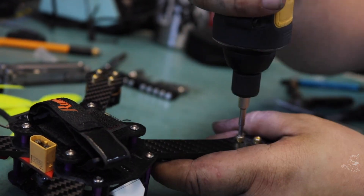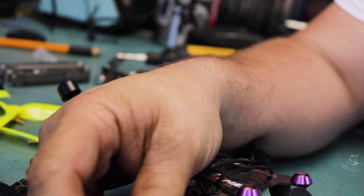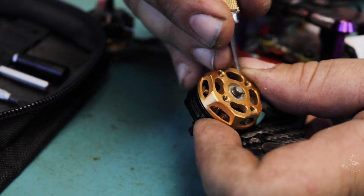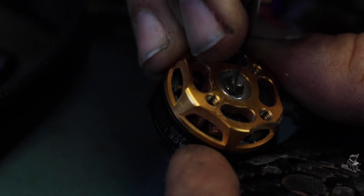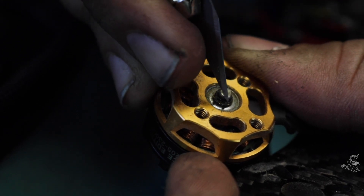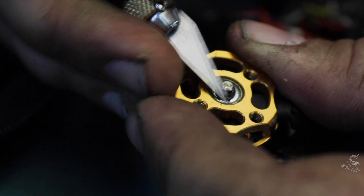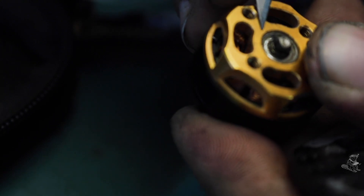Let's start by getting one of these motors off. Now you can see you can actually get to it. There are like three different kinds of e-clips. These ones are split but they have little fins. I like these because you can just use an exacto blade and bend it out of shape a little bit, but you can always bend it back. Got it over the top there — you just lift it off.